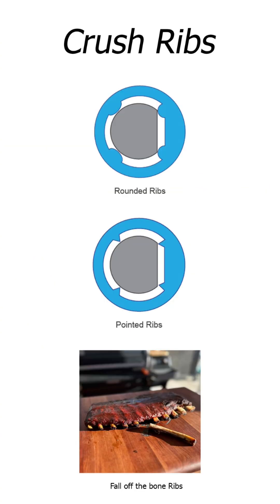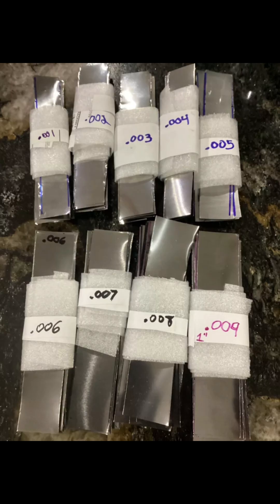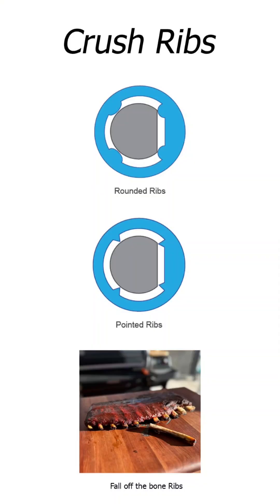So today's quick design tip is to utilize crush ribs. The idea is similar to using packing in a vise or stuffing a pillow behind a headboard for when you have too much motion. Whatever variances your printer might have should get averaged amongst the ribs.